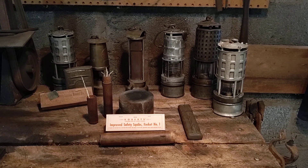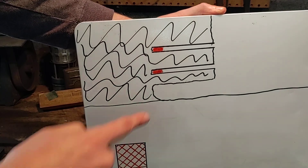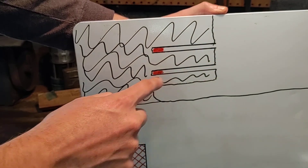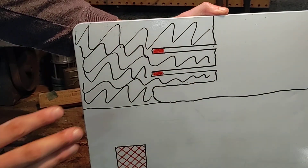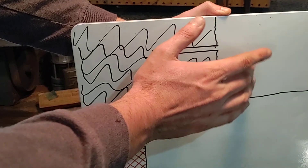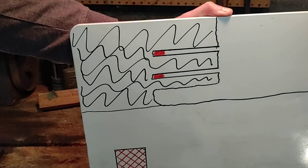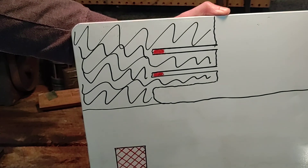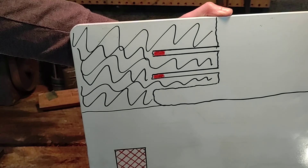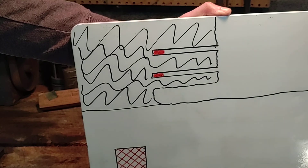Looking at a diagram here — imagine this is our face, here's our floor. We would drill our holes back, place our charges, tamp them, and set them off. But all this energy will still be directed back out this way because there's no resistance here. So if you were blasting coal or hard rock, especially with coal, this would basically pulverize it, which is not what you wanted. You wanted larger pieces so they could be broken at the breaker and sorted into different sizes — pulverized dust back in the day didn't really have a use.